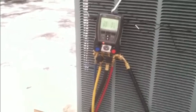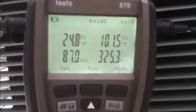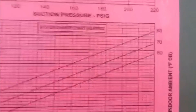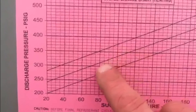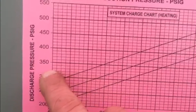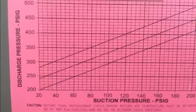We've got the unit running on what was in that recovery tank from the factory charge. We've got 325 over 87. If we come over here to our chart for checking the temperature — following 70 degrees down and hitting 85 — that puts us at right about 320. So we are golden. Back to running like she's supposed to.